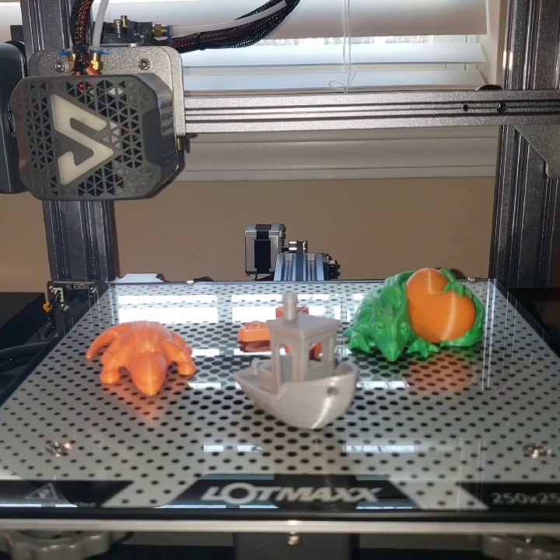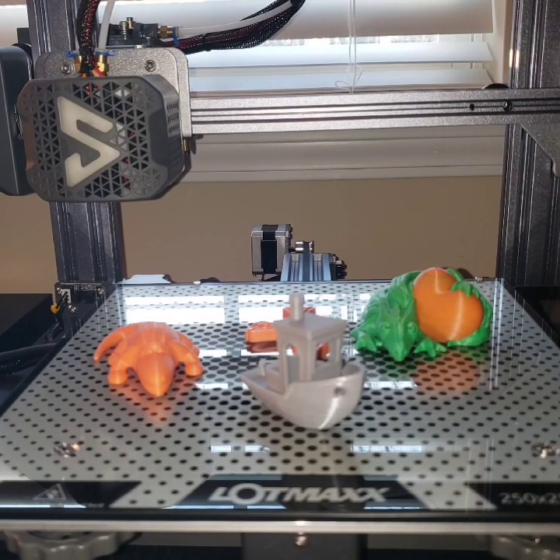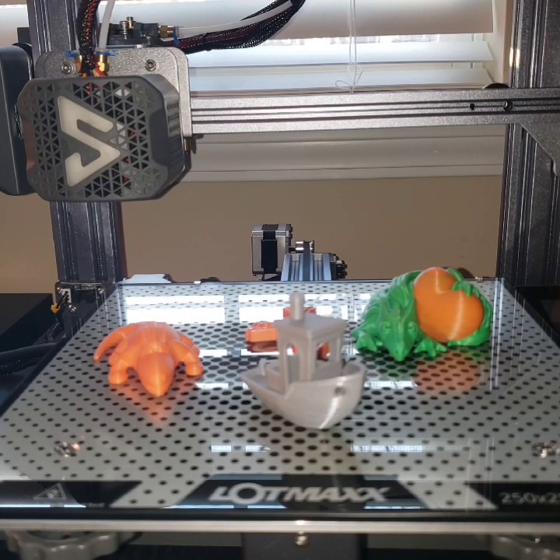Final thoughts on the V3? I like it. It has good print quality right out of the box, as you can see in the Benchy. The only changes I made were to the temperature. It's relatively quiet as far as 3D printers go, and it can print in two colors. The big downfall is the glass bed — I really wish they would have included a PEI magnetic removable sheet. Those new to the hobby will have issues with this plain glass bed since there's no adhesion promotion at all. The other issue is the proprietary firmware — the fact that you can't run Klipper or Marlin on this is really off-putting. Well, that's my review. Let me know what you think of the V3 in the comments, and as always, happy printing.